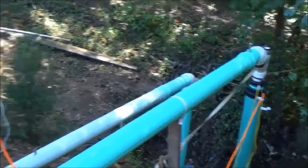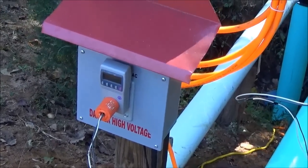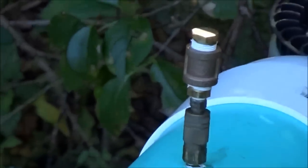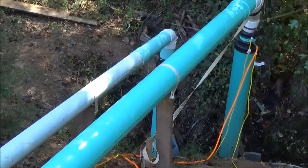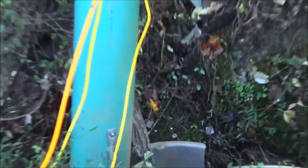Engineer 775 continually trying to improve our understanding of our mini hydro setup. We've added a light bar and a vacuum gauge so we can see what's happening on the suction side of the turbine, and we can also measure it on the inlet side to compare before it goes through the turbine. We also stepped up from the six-inch setup to an eight-inch inlet and a ten-inch tail, with about nine feet of head from the turbine down into a Rubbermaid container so we don't erode the ground.